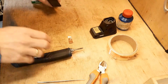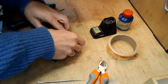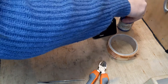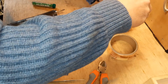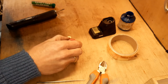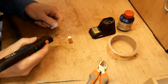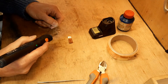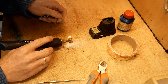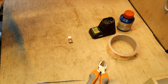The next thing we need to know is: can we solder to this copper tape? I'm gonna scuff it up a little. It's very thin — it's almost like gold leaf. A little bit of flux, not sure if it's necessary. Yeah, that works well. That's a success. That's a nice bead.